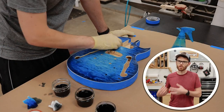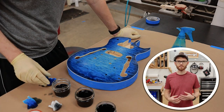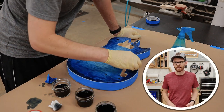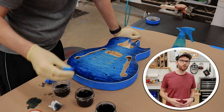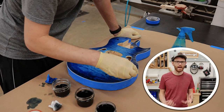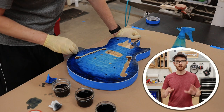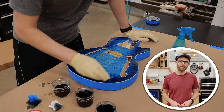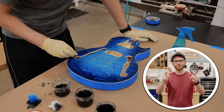This is one of those projects I was really nervous about trying — I almost didn't even use the dye. I was just going to clear coat the guitar because I liked the grain and was afraid I'd ruin it by applying the dye wrong and having to paint it. But once I did it, it really wasn't that bad and everything turned out really well. Just remember to go slow, working light to dark, and I think you'll be really happy with the end results. I'll be doing a full build video of the rest of the guitar in a separate video, so I'll have a link for you. Thanks for watching and I'll see you in the next one.